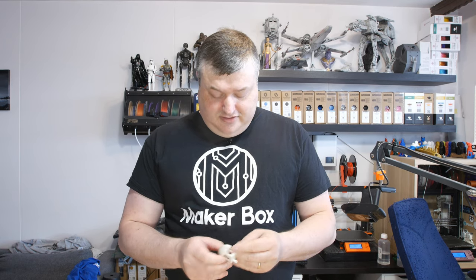I'm not agreeing with the statements on the label that it's a good mechanical material. It's very very stiff but also very brittle, so it's no use for anything I think. The color is like a beige-white, pretty much like old computer cases back in the day, and I believe that was the reason Chris decided on this filament — to do a retro MK3. But my results for layer adhesion are not very good.